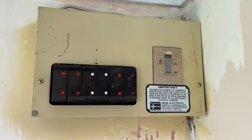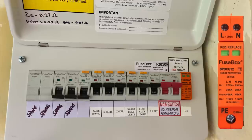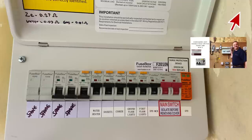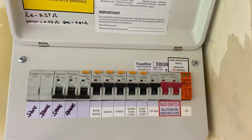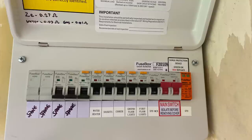To relate this to the real world - you've turned up at an installation, all circuits are energised and working, and you're trying to suggest that consumer unit needs replacing. We can now see the benefits: introducing the SPD gives protection against over voltages they didn't have before, and the individual RCBO protection means only the unhealthy circuit will operate under fault conditions. We haven't gone into IP ratings or key/tool access for the enclosure - that's in a video called Understanding My Consumer Unit. In the electrical workshop, the likelihood is our RCD main switch will be AC type, and we should now be aware we should be moving away from it and using Type A RCBOs as a minimum to protect our individual outgoing circuits. I hope this video has been some help.